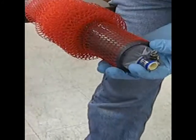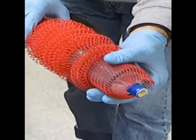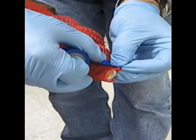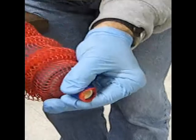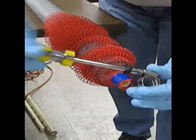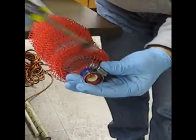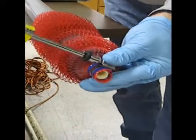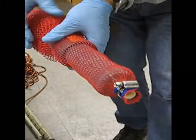I'm going to take the clamp off using a nut driver, loosen it and remove it. Then I take that red mesh and push it back over here — this can be fairly approximate — and apply electrical tape over it. It's pretty important to tape this right on top of the other layer of tape that was below it, wrapping about twice. Then I bring the clamp back, open it up a bit, put it back on, and clamp down to hold the red mesh and the white mesh inside. This piece must be tightened very tight.